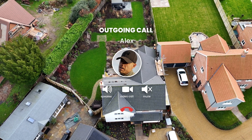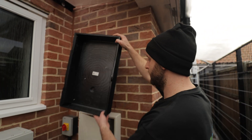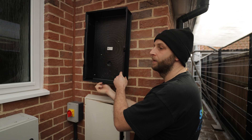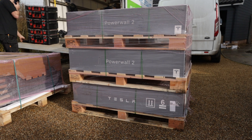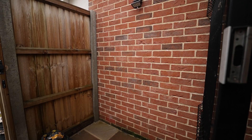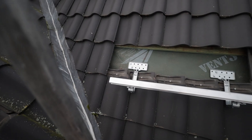The team arrived at 20 to 11 — not quite the 10 o'clock start planned. Here's our supply. The gateway needs to go here. There's quite a lot going on with this one because we've got Enphase. In this box we've got to get the supply out for our Envoy for the Enphase, and we've also got to get three supplies out for our microinverters — three radials for those — plus three supplies out for the Powerwalls and comms. The Enphase gateway is going up here with this box in the way, so everything's going to come out the bottom of the gateway and run down.